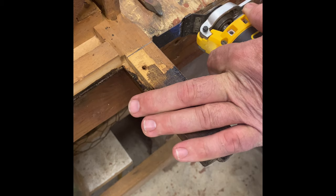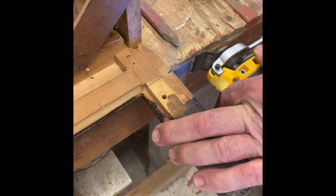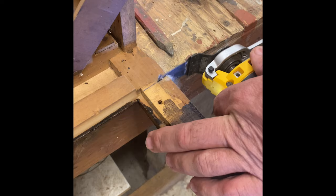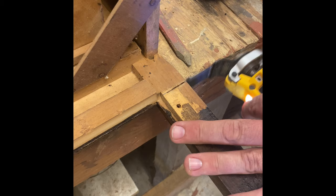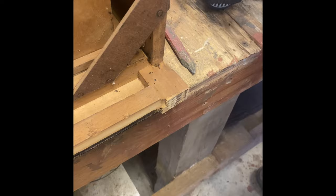However, this piece was racked a little bit. It wasn't square. After we got all of that installed and got it on there, it still didn't stand up straight. So we took measurements on each side, and it turned out one side was about an eighth of an inch longer than the other, so it was a little bit crooked. And we took those back out and put a 3/4 inch, I believe it was a 3/4 inch, maybe it was a 5/8 piece of plywood in the bottom to square it up and make it a little more solid, and then we attached the legs to that.